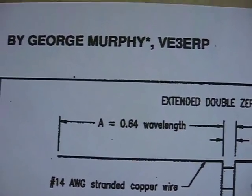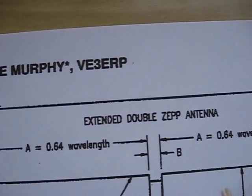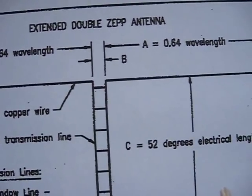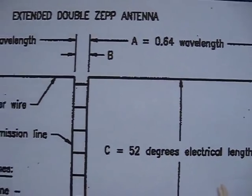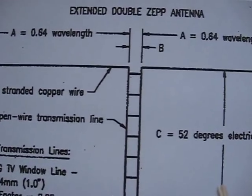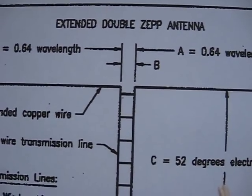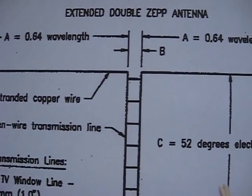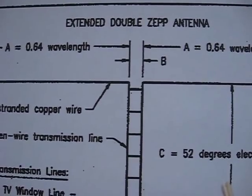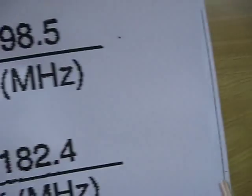This is all by George Murphy. The elements, as you see there, is a broadside propagation antenna — you probably already know of course. So if the wire is north-south, the best propagation will be east-west, unless you can rotate it.